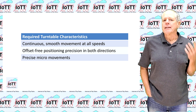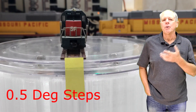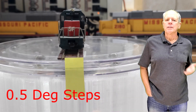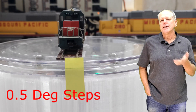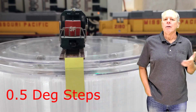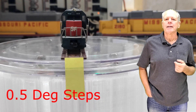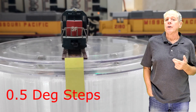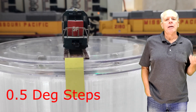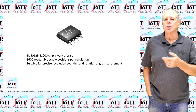The third characteristic to be tested is very small movements of half a degree. I issued a series of commands with position increasing by 0.5 degrees in one direction, then changed the direction and repeated the sequence in the other direction. This was actually pretty convincing. Each step appears to be of a consistent angle and the movement can clearly be seen, which means there is no directional offset on this small level of movements, which speaks for the sensor. So for the offset in test 2, I think I really need to focus on the mechanical setup. What the test shows for my work on the train-side sensor is that the magnetic chip works extremely well as a position sensor. The stable resolution is about 0.1 degrees, so 3600 individual, repeatable, and stable positions per revolution are possible.